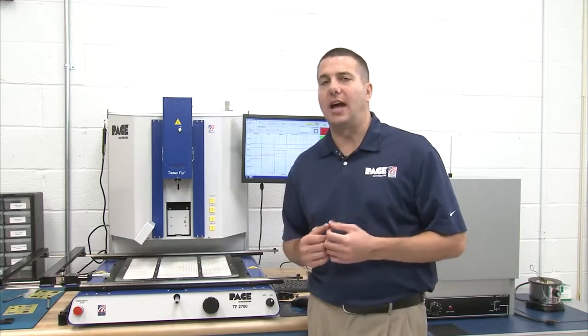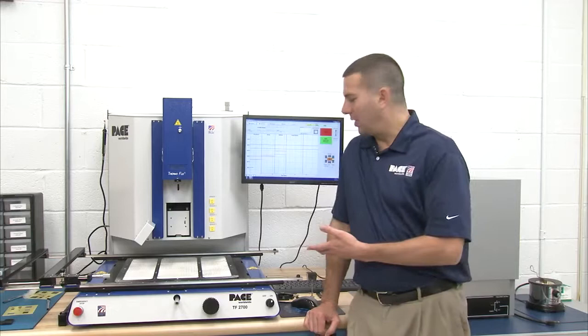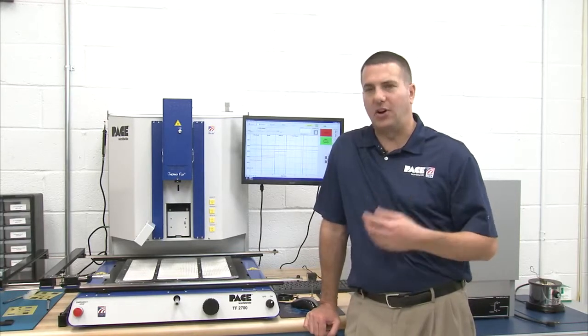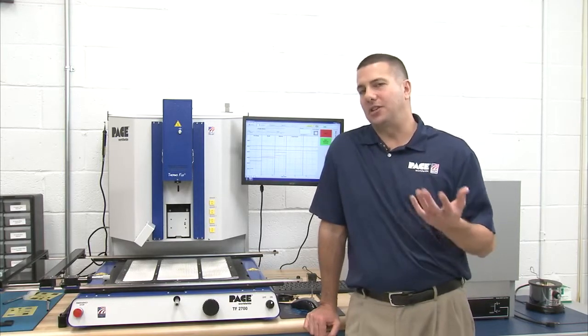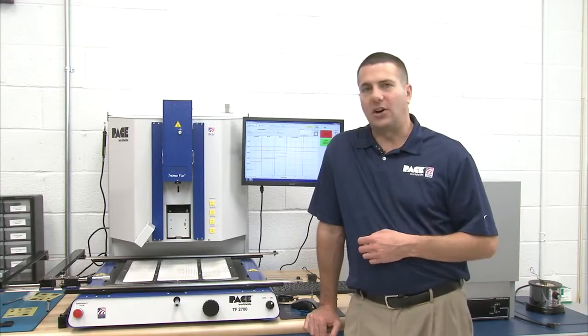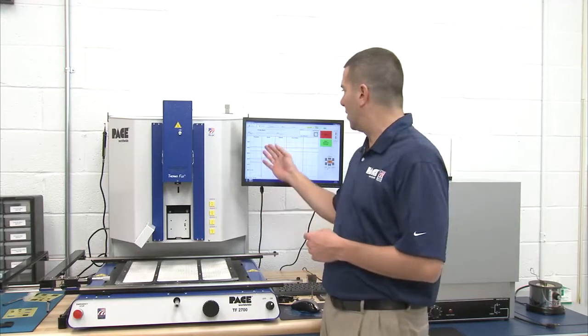So we use some general guidelines when doing demos. We're working with lead-free circuit boards and components. So we're just going to target around 150 degrees, basically anywhere from 140 to 160 degrees, but targeting 150 degrees coming out of preheat. We're going to target anywhere between 175 and 195 degrees coming out of our soak zone.